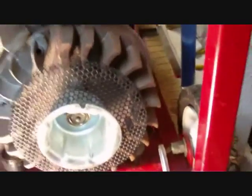In my case, this unit got progressively harder to start over the time period I've owned it. These things take a lot of effort to pull a cord. The outer cover here just unbolts — it's a self-contained unit, which is nice. You don't have to worry about how you put it back on; as long as you put it on with the right feel, it'll go right back on. That's number one — you have to remove this cover. After we polish the plate with some very fine sandpaper — in this case I'm going to use 400-grit — and I'm talking about this surface right in here, primarily this spot.